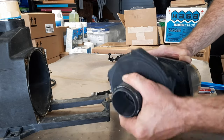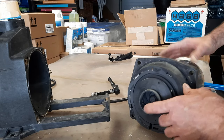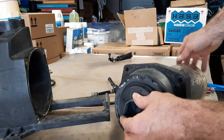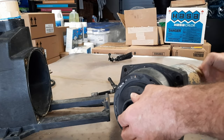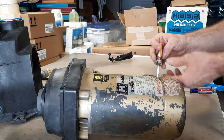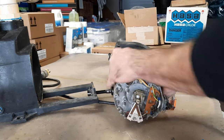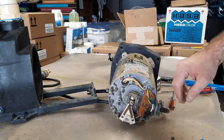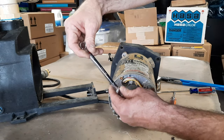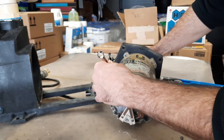We're going to pull the diffuser off. The next step is to take this impeller off. In order to get a grip on this impeller, on the back of the motor shaft there's access underneath this back power cap where we can get our 7/16 wrench on the actual shaft itself. Use the quarter inch driver to take out the screws holding on this cap. Now you can see the back of the motor — underneath the contacts there's a shaft, and the 7/16 inch wrench, you turn it so the wrench will lock right on that and now that impeller is locked.